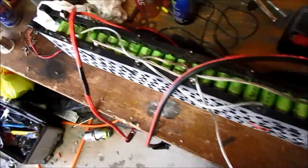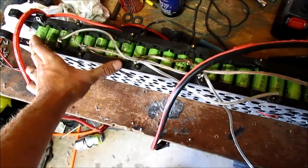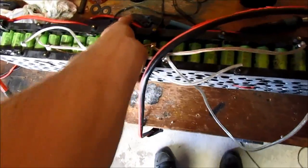This is as far as I'm going to get today. I got a set of four gauge booster cables coming off of it — not quite adequate for this much power. I have all the individual cells wired in parallel with each other. So this 12 volt pack, all of its four cells are in parallel with this 12 volt pack, with all of its cells in parallel with this 12 volt pack. And then all these 12 volt packs individually are also in parallel. I just need to run balance leads off of it. It has a lot of power.